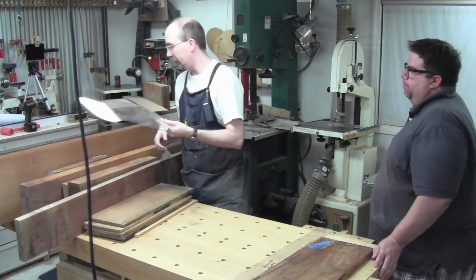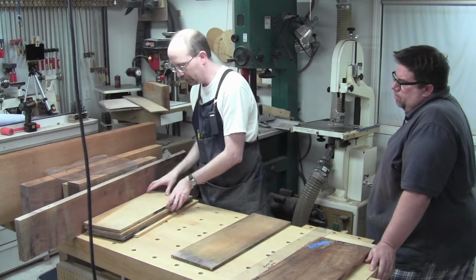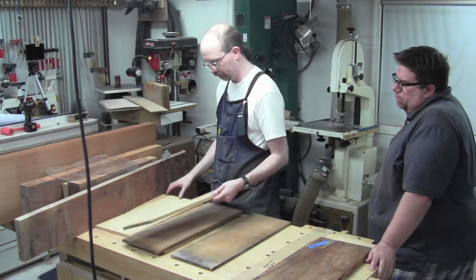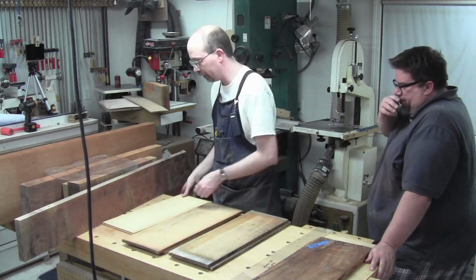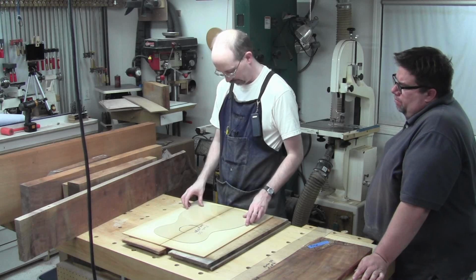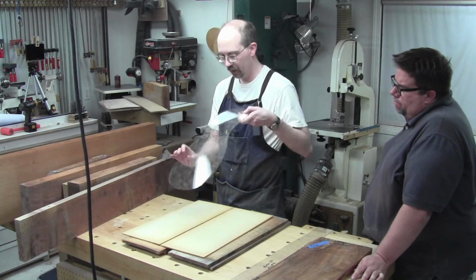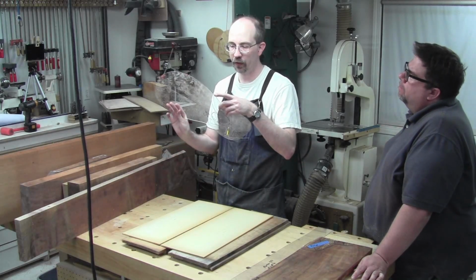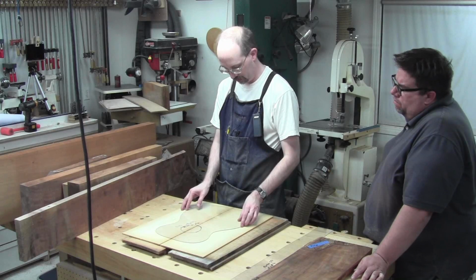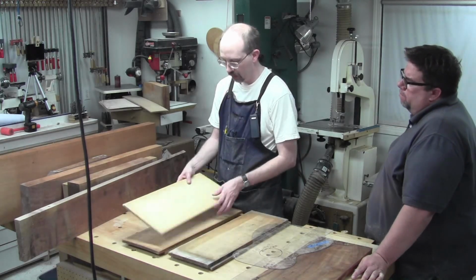Okay. And then it's kind of spruce for the top. I can resaw this piece. It's got some neat fiddle in it. That one's nicely quartered. I have a large quantity of, well, not a large, this is my entire supply of spruce. This one works around this little defect nicely. I've got a little ding here. Yeah, might work well with that one. That'd be a very white, pale, plain looking piece, but it's nice.